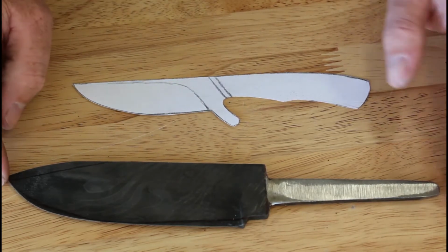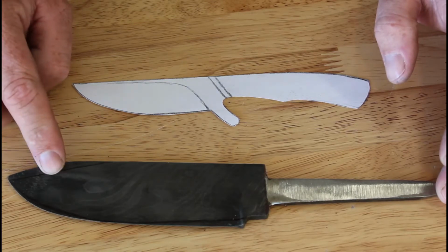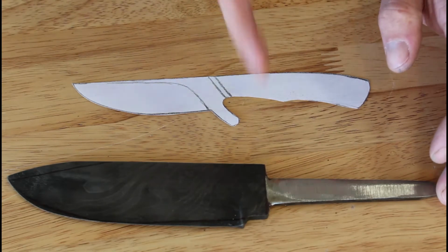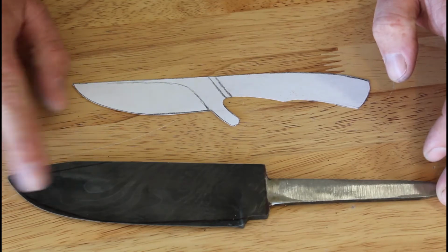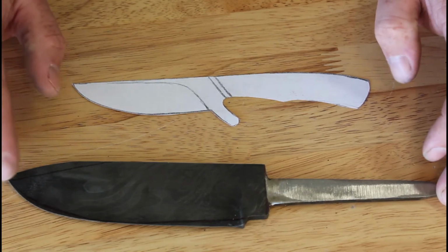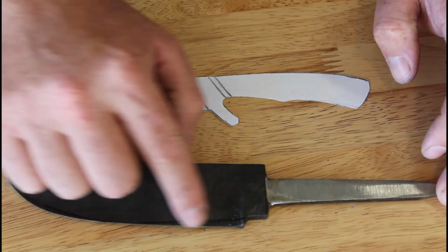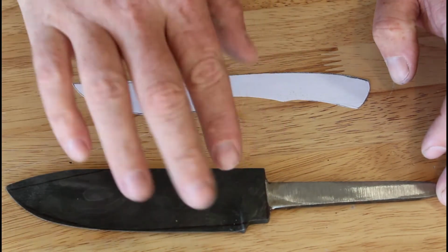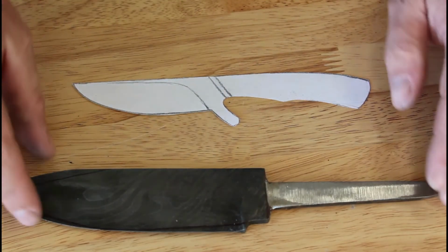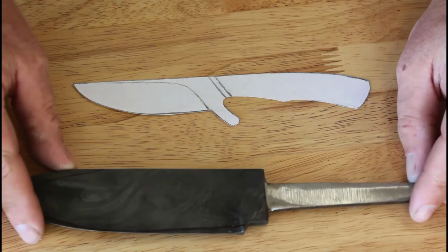The other thing is I really don't like the design of this low layer Damascus knife I had done. It's not square here, so I already have to fix some things. This knife's already been heat treated and tempered, and I'm probably going to reset that whole process and cross my fingers on it. I've got some lines here. I want to reprofile this thing. I could probably get away with the reprofiling, but I'm also changing my bevel grind quite a bit.